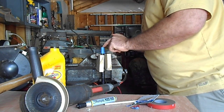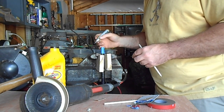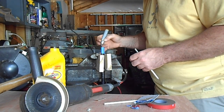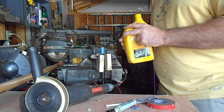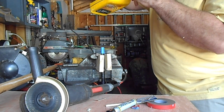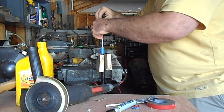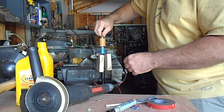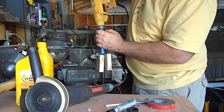I did a little bit by hand and I can see it's touching one side slightly more than the other. I'm going to take a sharpie and touch up the end of the barrel just to give me a guide as to how much I need to keep going. I'll put just a couple of drops of oil on the end — I don't want to get it all over the sandpaper.